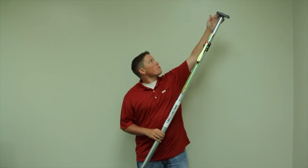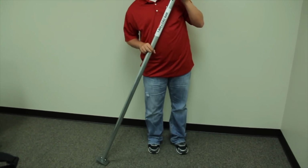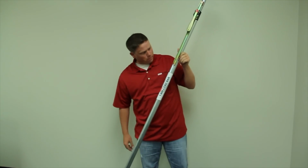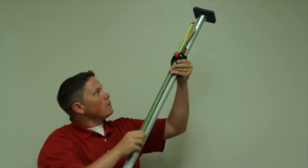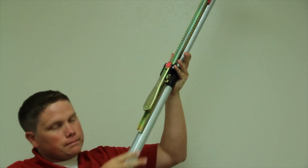There are three primary components to a load bar. First, there are the rubber booted feet that press against the walls of the trailer to hold the load bar in place. Second is the base steel tubing of the bar that provides the length and strength of the load bar. And last, and most importantly, is the rack and pinion mechanism that represents the moving parts of the load bar and provides the gear action that presses the feet towards the trailer's walls.